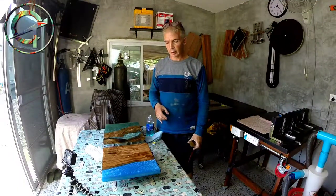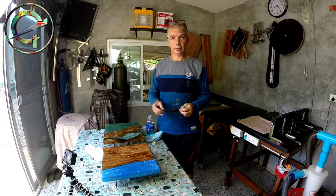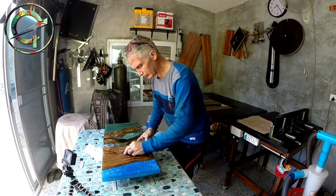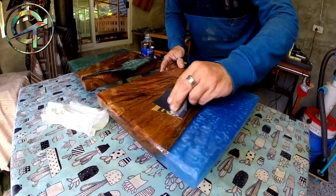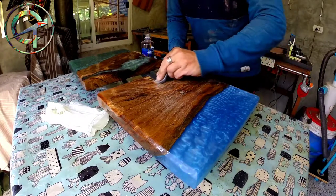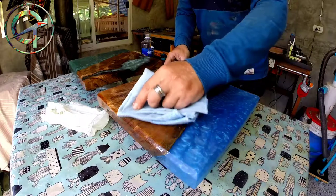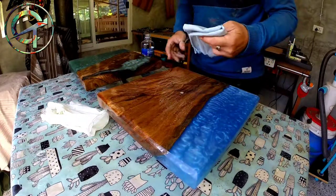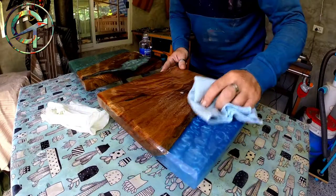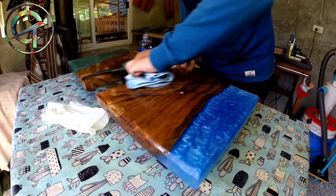I waited 24 hours — the epoxy first seal coat is cured. With 240 grit sandpaper I'm sanding the piece. Don't worry about imperfections at this point. The seal coat is a process that requires three or four epoxy layers at least. We are going to end up with a perfect homogenous resin surface, imperfection-free. Take your time and sand the piece trying to eliminate imperfections and most importantly any air bubbles left over. In my case I have none because I'm working with a heavy non-porous timber and the first seal coat did a great job sealing the surface completely. With rubbing alcohol I remove all the fine sanded epoxy dust left after sanding.